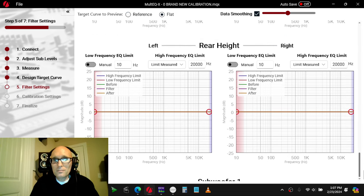Now thinking about it, looking at it this way, for the measuring and the time alignment part, keeping things in 24-bit 48 is a good idea. To be fair, everything after that, when you're actually EQing and having to export like this, it is better to measure up to 250 hertz. It's just more manageable. It's easier with the current method that I'm using. Yeah. So, all right. Now, these are just corrections. Actually, this is the flat. So let's undo the alignment so we can compare it to the new version. Okay, let's see. Yeah, we'll do 250, 1M.